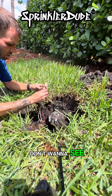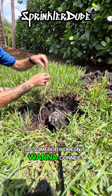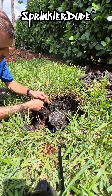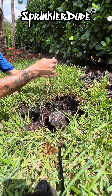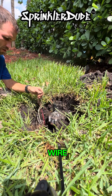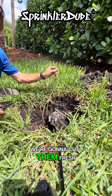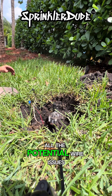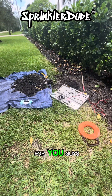The other thing we don't want to see is daisy chaining. If somebody doesn't want to connect to that wire nut and instead uses this piece of wire to connect from here to here — that's daisy chaining. Don't do that. What we're going to do is cut off that bad piece of wire, strip it back, and then cut the common fresh. That is how you replace the solenoid and get rid of all the potential wire issues.